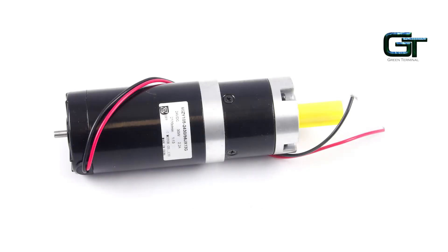Now, let's have a look at the DC motor. A DC motor has two terminals. When we apply a potential difference across the two, it will rotate in one direction. If we reverse the polarity, it will rotate in the opposite direction. To reverse a DC motor, you need to be able to reverse the direction of the current in the motor. The easiest way to do this is using an H-Bridge circuit.